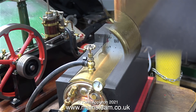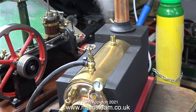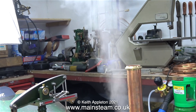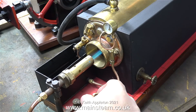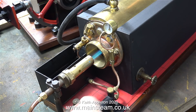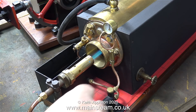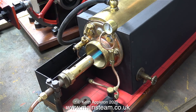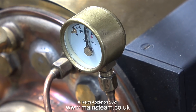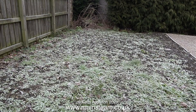I'm going to stop the engine and raise the pressure even further. When the pressure reaches 60 pounds per square inch the boiler's safety valve blows off. When you work with steam engines you soon realise there's always something to do — there's a definite sequential order. With a gas fired boiler there's less to do because you don't have to consider shoveling coal into the firebox. As the safety valve is blowing off and wasting steam, now is a good time to pump some more water in. Today is quite cold at minus two.